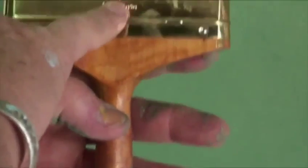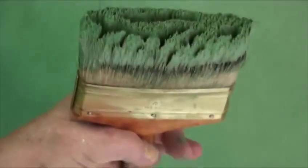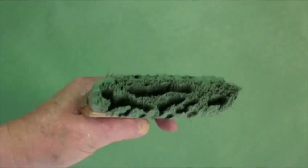This badger pure bristle brush is made in America and has a 4 inch stamp on the ferrule — 4 inches is just over 100mm. There will be slight texture showing the direction of the cross applications, and that's all part of the look. This is the Wattle Brushed Suede in another colour; it has been applied with a larger brush in a scallop effect, which is still applied with an overlapping technique.